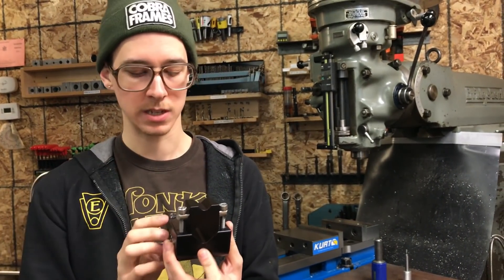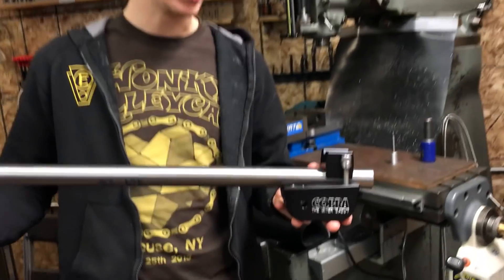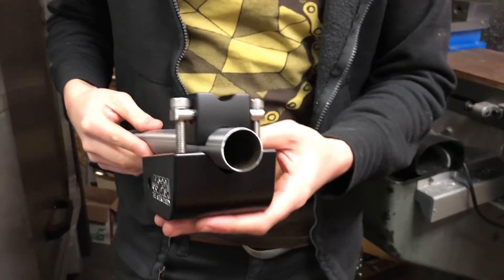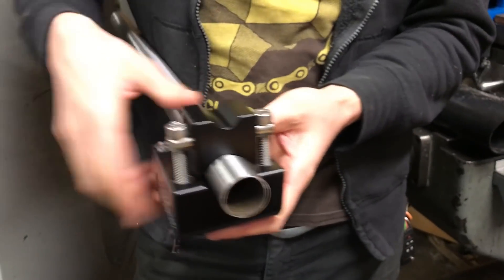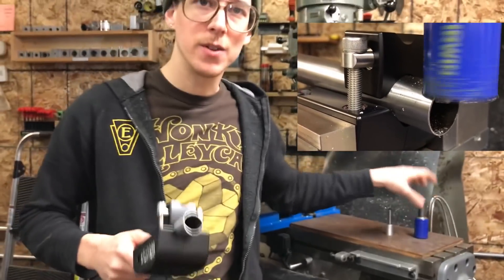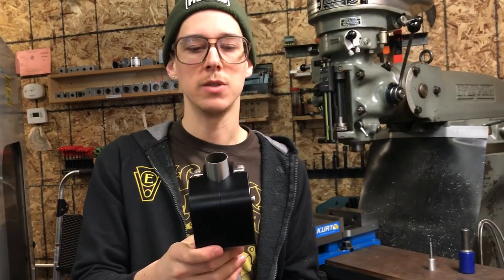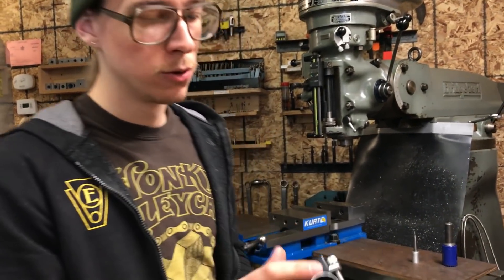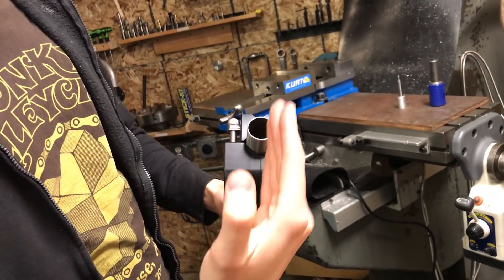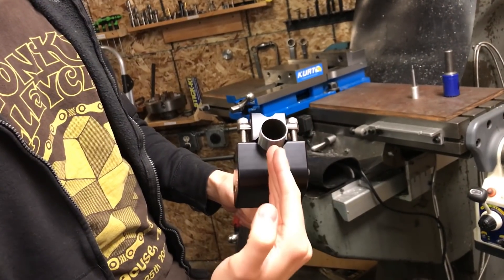I have the tube right here and I loaded it up. This is an inch-and-an-eighth tube — 28.6 millimeters. When I make a cut on this, I want to be on the tube centerline, not off to one side. There are different ways to do that. What's cool about this is I designed it to be three inches wide, so the centerline is one and a half inches in from this side.